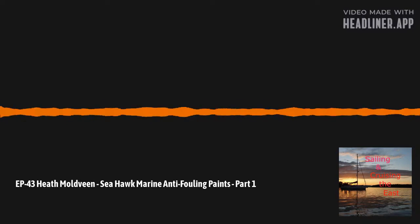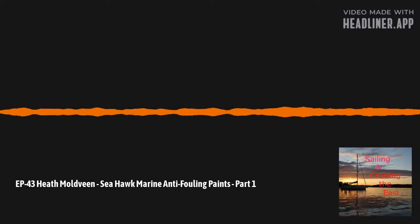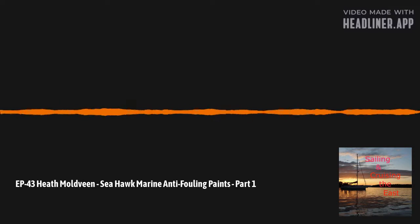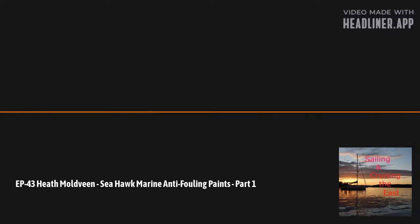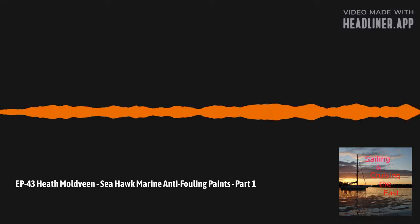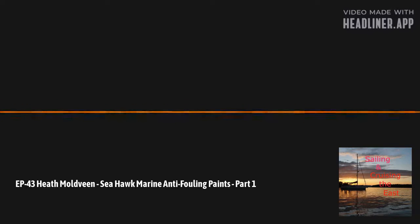And then you have this category of anti-fouling paints, ablative anti-fouling paints. Ablative paints wear away over time. Think of them like a bar of soap, right? You put that bar of soap in water, and water runs over it, and you get a little bit of polishing. Now, you put that bar of soap, and the water's running over it faster, you get a little more polishing.